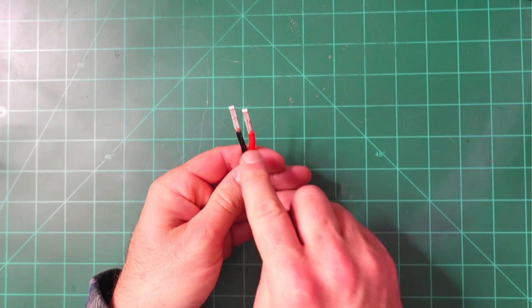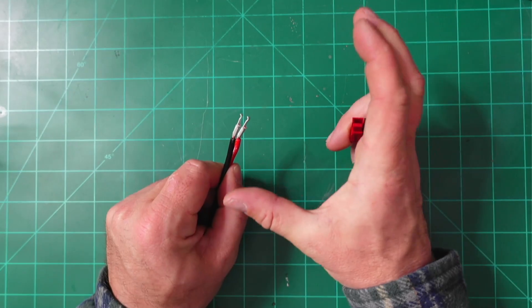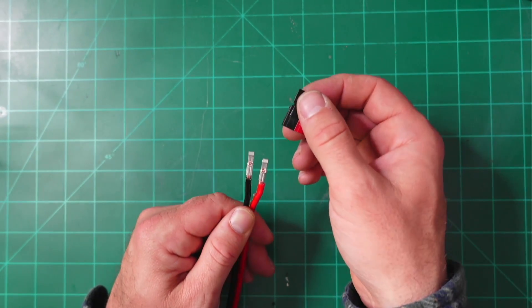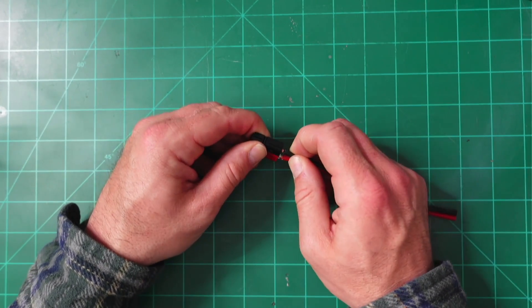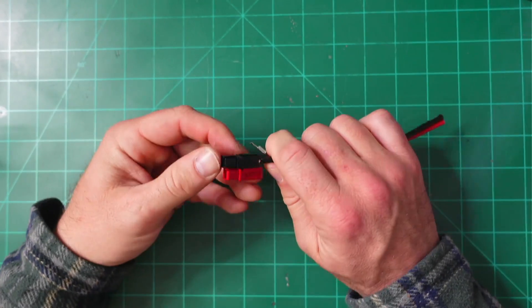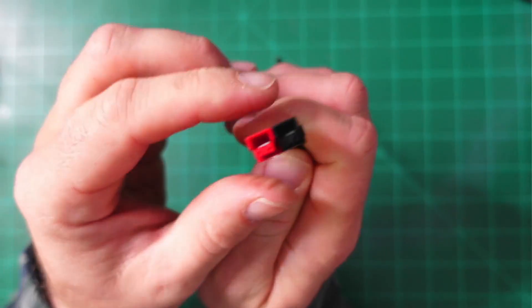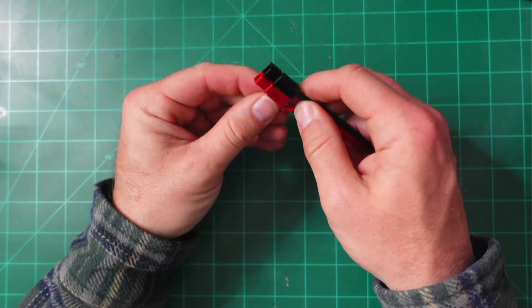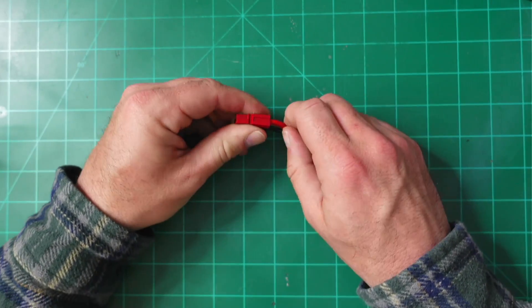The last step — click it — is super easy. Black on the left, red on the right, click it down tonight. The little cusp or grip should be facing down. Push the black connector in with your finger and apply some pressure — you'll feel it slide in over the metal piece internal to the PowerPole Anderson connector, and then you'll hear an audible click. That means it's in place and it's not going anywhere. Do the same with the red one.